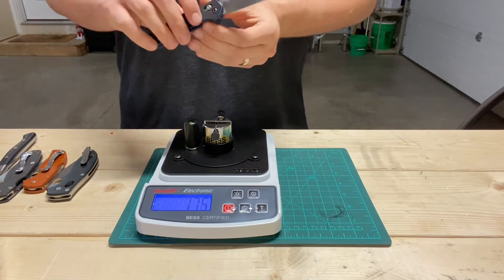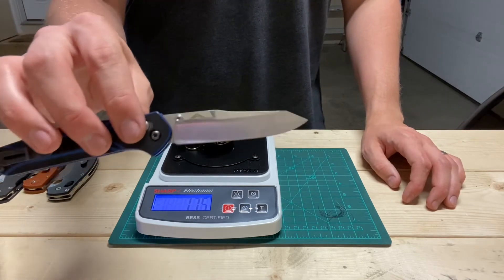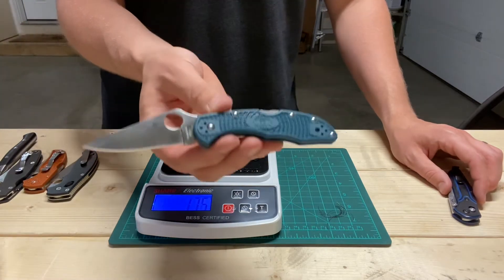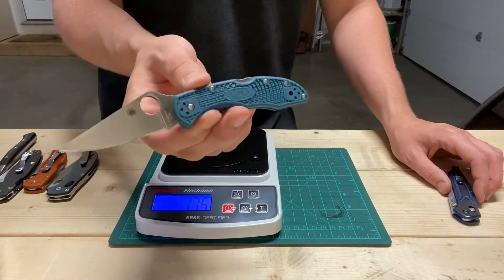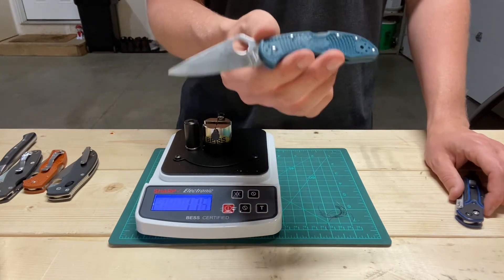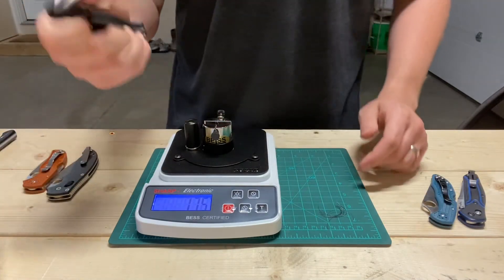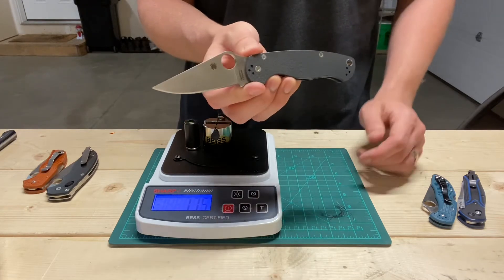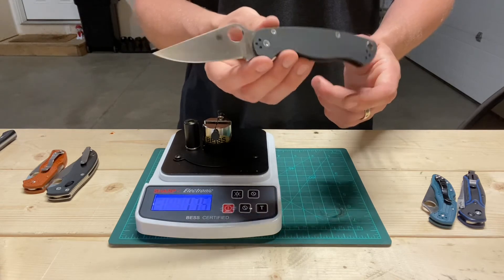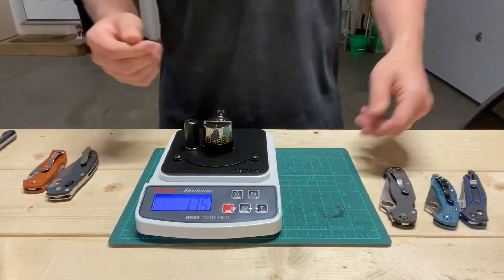Results — all of these sharpened on the Choceras. 20CV had an average of 172.5. K390, at 64.5–65 Rockwell, super hard, 17% vanadium carbide, sharpened on the Choceras with I think 3 passes per side on 4 micron CBN on leather — average about 210. M4, about 6.5% vanadium carbide, 13.5% total carbide, at roughly 63 Rockwell — averaged about 195, with probably around 5 strops per side.